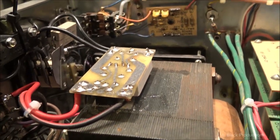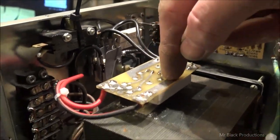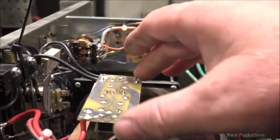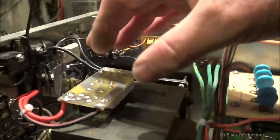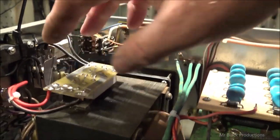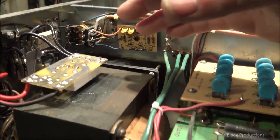Now, me personally, I'd take this out, because there is an actual resistor here for this job. But I'm going to leave it in because people swear by these. Now, I epoxied this in, okay? So I staged it with double-sided stick tape, and then I physically epoxied the thing to the transformer. So it cannot come off and hit the cabinet, short out and cause any more problems.